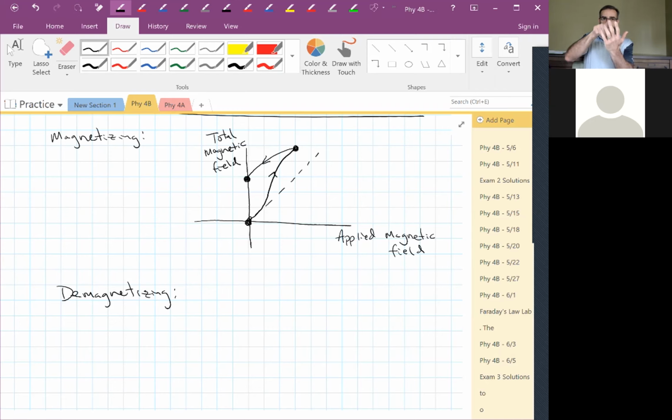And then it hits the next point on the screen, and then it hits the next point. One electron beam goes along and hits the points in one row, and then the next row, and then the next row, and it goes through the whole screen. And by the time it gets to the bottom, the first part is starting to fade out. It's not glowing anymore, and the electron beam starts again, working its way through.